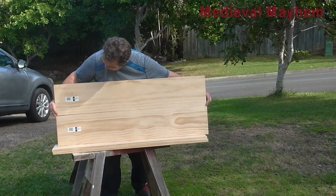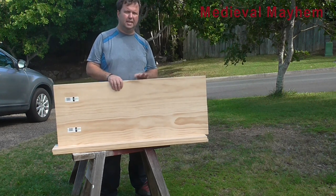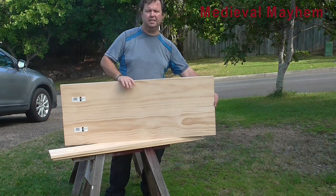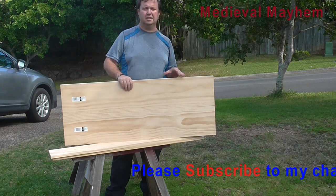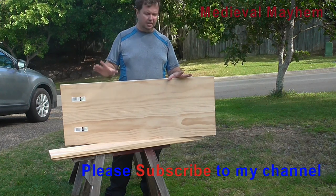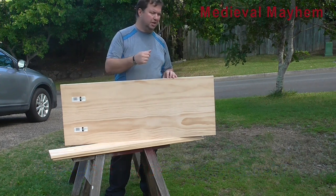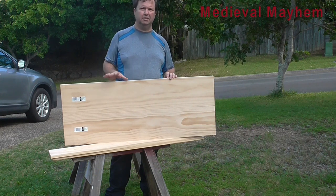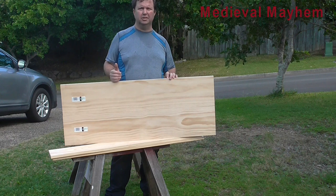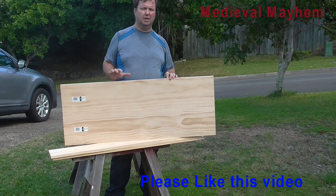I've got two pieces here which are 23 and a half centimeters wide, and I'm simply going to butt join these together and clamp them into place to make wider pieces. This is going to be the front and the two shorter ends. The glue I'm going to use is Sikaflex, and then I'm simply going to clamp them in place. Once I've got these done, we're going to measure, mark, and cut the individual pieces out. I'm going to leave this to dry for at least a day — the assembly, which takes place roughly two days' time, is a fairly quick process once everything's marked out and cut.